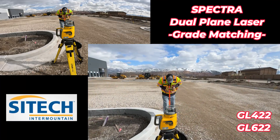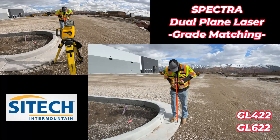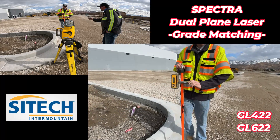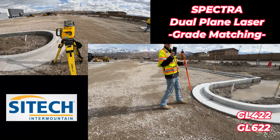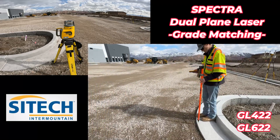I'm going to hit my grade on this side. I'm going to move it down just slightly. I'm going to leave it in that position and lock down to this other curb line. If you don't have a buddy with you, you can always use the remote. I'm going to set down here on this end where I want to match to.